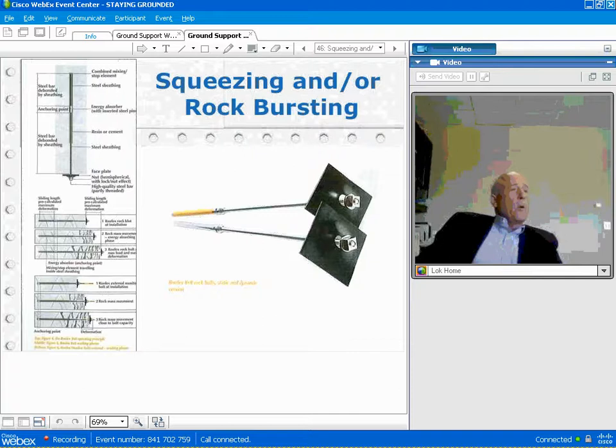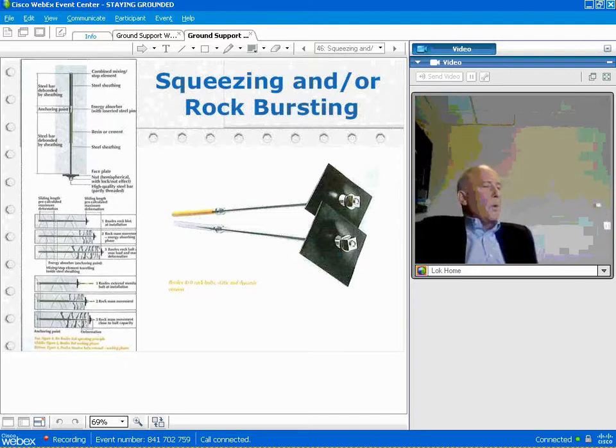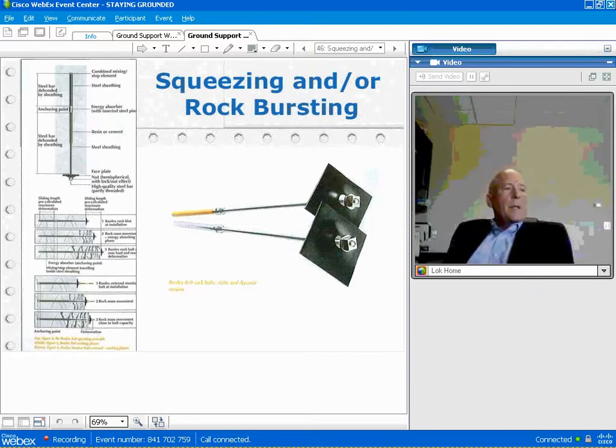I think these expandable, stretchable, or yieldable rock bolts are a great invention, and I think we're going to start to use them. We're just starting on a couple of projects, but I think we're going to see them enter in a big way into our tough conditions. And I can see how we can rotate the cutter head even with full loose rock all the way around it. And if we get this system in behind the cutter head as soon as we can, I think we can just bore through the rock conditions and put up these yielding supports and make good progress.